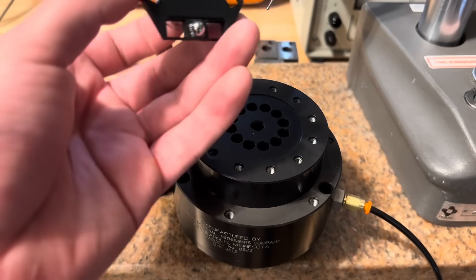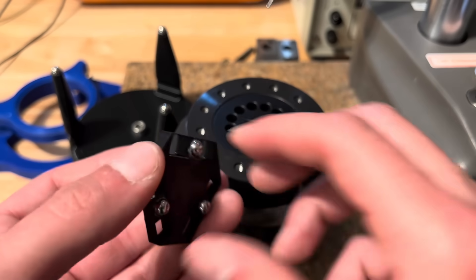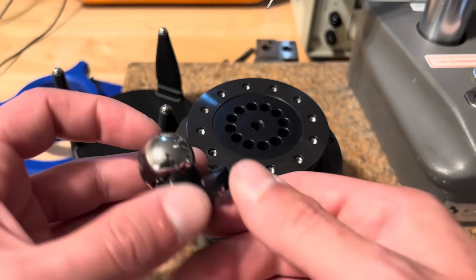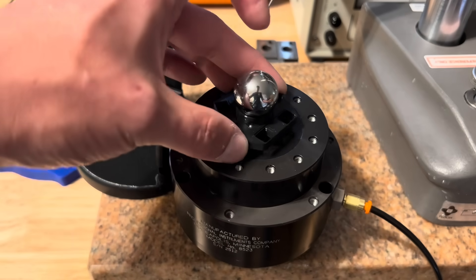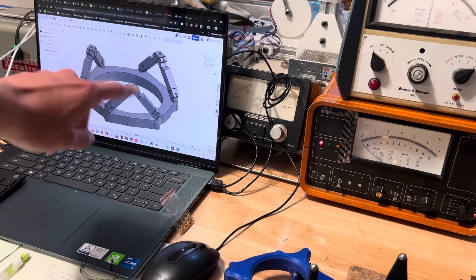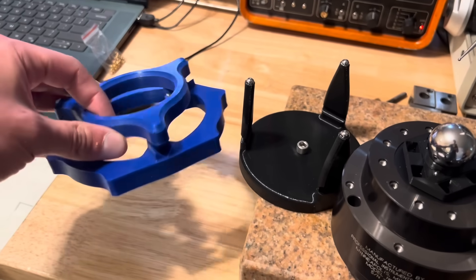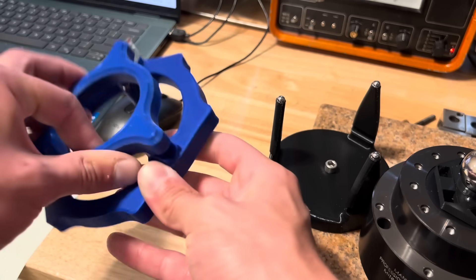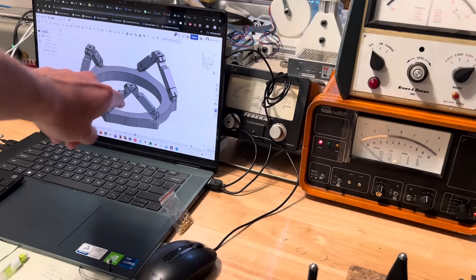I really love this concept, and in fact it's not taken to its fullest extent in this application. We got rid of one friction source: the ball sliding in the V is now replaced with a flexural bearing — that's good. But we still have more frictional sources in theory, which is the ball rolling and pivoting in the conical seat. You can actually take this to its fullest extent — this design over here is the flexure bipod mount. That is this taken to the max, and every degree of freedom is kinematically identical to a Maxwell coupling, except it's all flexural. The linear motion in the V is flexural, and all the rotary degrees of freedom that the ball has by pivoting are all replaced by degrees of freedom afforded by flexures. So this is for really high precision optics work.